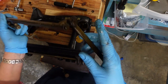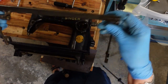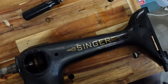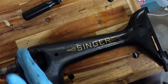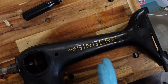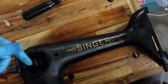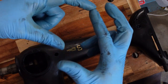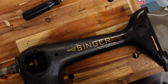And now with this out, I'll be a lot freer to go ahead and take this piece off so I can clean these independently. But for right now, I'm just going to leave it together so I can keep track of everything. Okay, so there is my other shaft here I want to remove, shaped like an L. So I have this part here and this part here is one unit, pulling it out. And up here, there's around the main shaft. This one comes up, there's like a clamp this way, a clamp this way that goes on top of it, a couple screws at each one of these places to pull out, and then I should be able to pull the whole bottom section out.